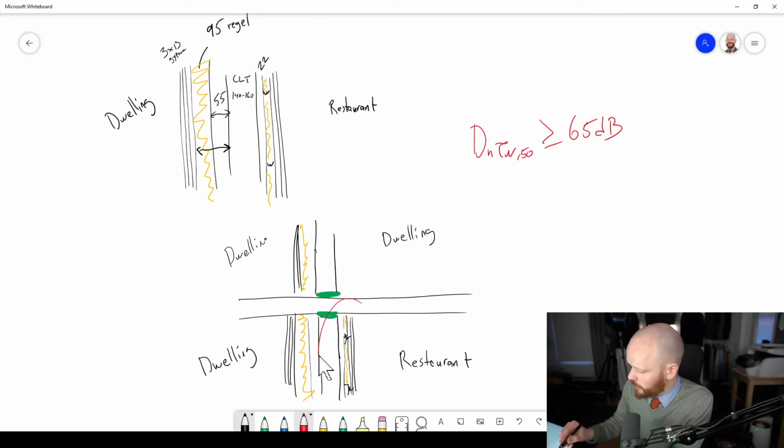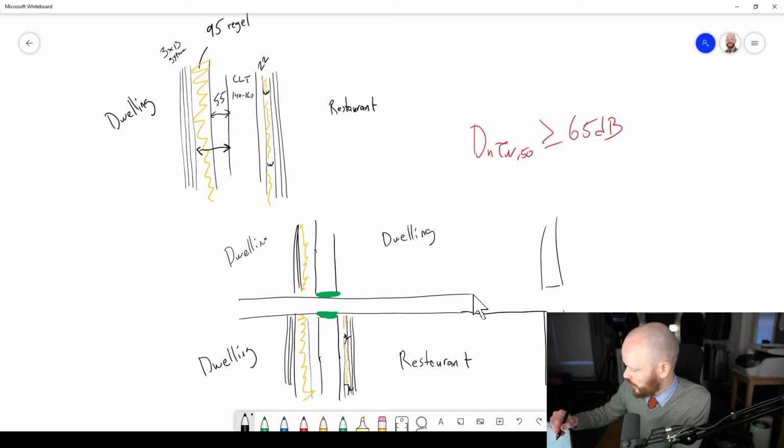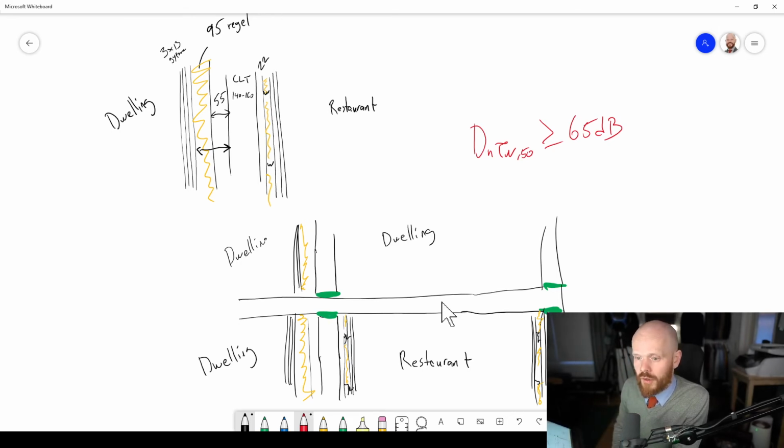And remember, this is also important if the outer wall is also perhaps load carrying. Let's say it's a CLT wall out here, and this is the street. I don't bother about drawing the whole facade, but on all the load-bearing walls I would recommend this extra installation, because you can get flanking transmission in any direction. So don't forget that. And then of course you need a floor structure that is a monster as well.